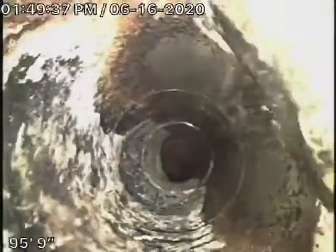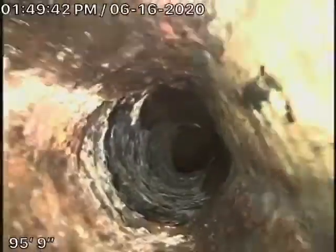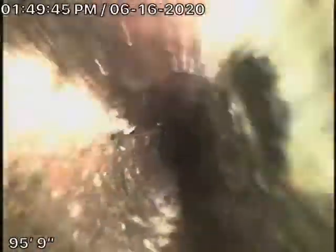It's all ABS plastic outside, then it goes into a cast-iron pipe. The ABS is all good outside. We're thinking it might go through a pump. The cast-iron pipe underneath the house looks pretty good — just some minor rust buildup. Because we're looking at the inside of the pipe, we cannot see the outside, so the general inspector will crawl under the house and look at everything.